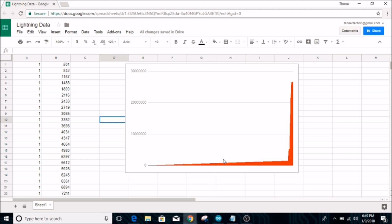Now in the beginning, the graph looks linear and it looks relatively stable. And this is probably because the lightning detector is triggering every half a second or something like that. And then right here, something weird happens. The graph gets super big. And this is because it's triggering at longer intervals of time, which is weird because it followed this relatively stable slope for about 4.5 hours. But then for the last 4 hours of the code running, it went all crazy. And there are more time intervals between when each lightning strike was recorded.